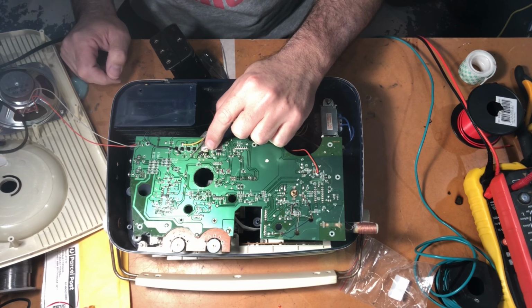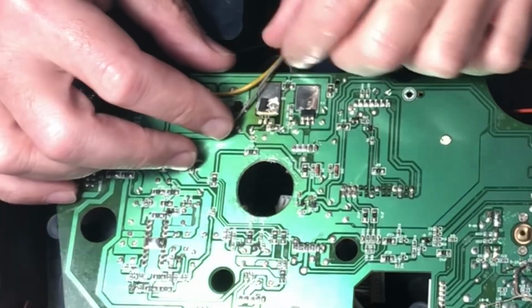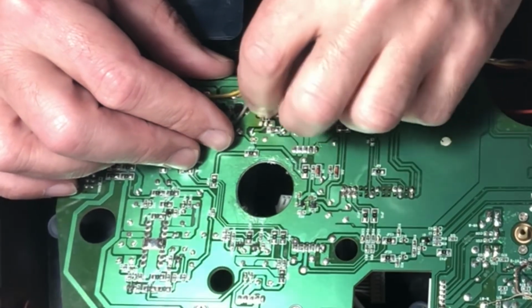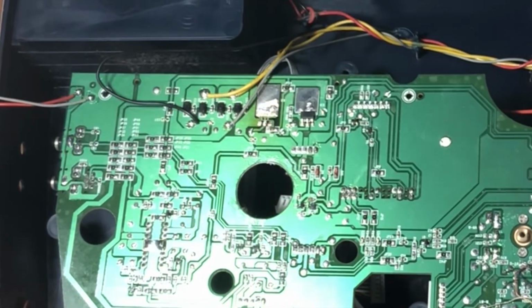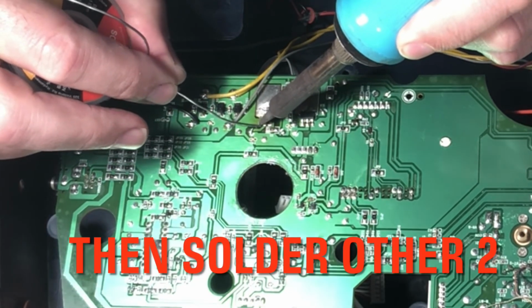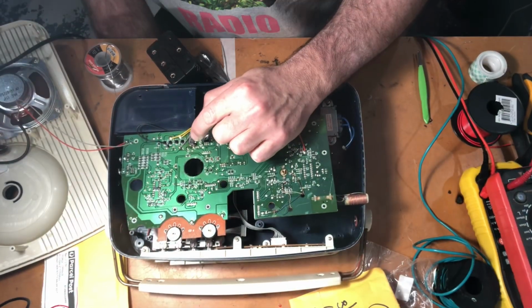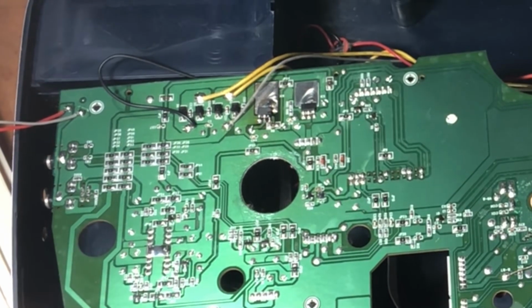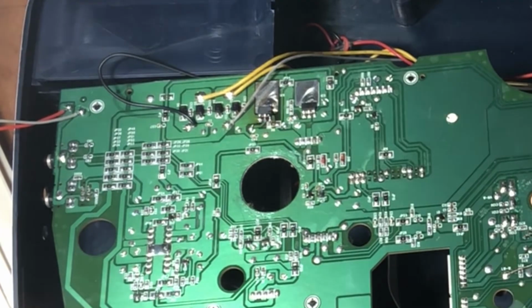This is where the little regulator is going to go. We have ripped a pad off, but I'm hoping there's enough track left there to make a contact with the regulator, and we'll see how we go. I'll try and get one pad down. Okay, well, we had to throw a little piece of lead in there to bridge the gap to the leg, but that is done now, so I guess it's time to do the smoke test.